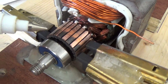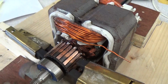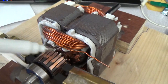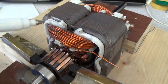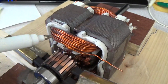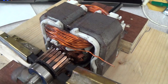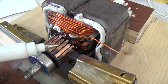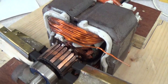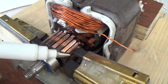I've been trying to fine-tune it, and the difficulty — which Tin Man was probably also getting — is that eventually there's a lock-up that happens between the rotor and the stator core. It just becomes like a magnet and eventually doesn't want to turn anymore, so it's really frustrating to work with because of that main problem and I can't get this to run really stable.